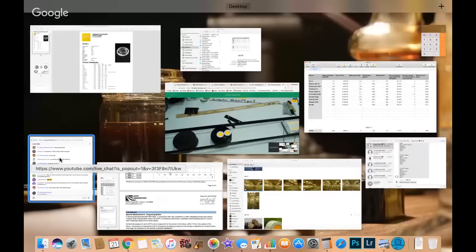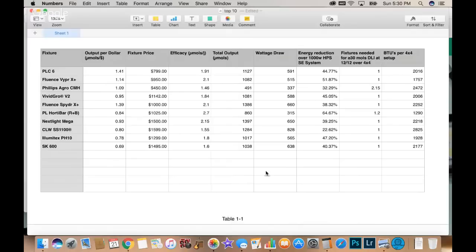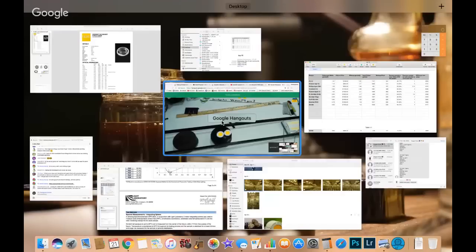Somebody else asked an interesting question about people maybe wanting to just copy your design and build it themselves. Not something you've really shied away from in the past, right? I showed you guys how to build PLC 250s long before I put them out, and it was the same concept. It's essentially just wiring COBs. I use a 600 watt driver, so I'm wiring in parallel versus a lot of you out there using constant current with series wiring. That might be a slight difference, but it's totally something you guys can look at.